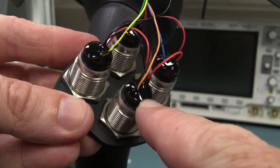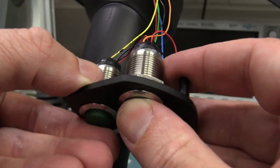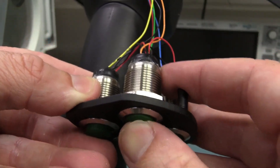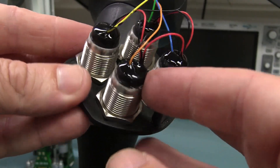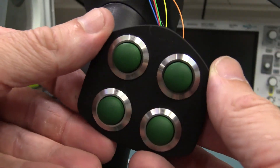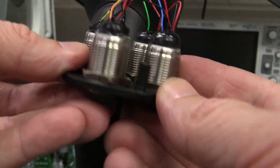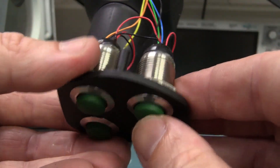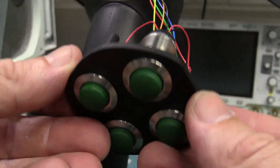But as I said, it's just a Hall Effect sensor, probably on a little board with a push button and a spring which then pushes a magnet in front of the Hall Effect sensor. And there's going to be a little board on there — it's got a PNP output. And Mark says this is rated for 20 million operations. The datasheet says 10 million, but they probably get a lot more than that — probably very conservatively rated.